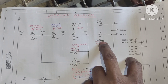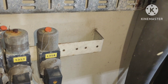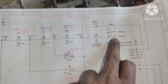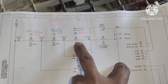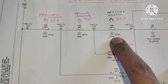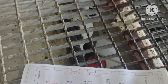I checked the force limitation for parking. Pressure switch 1314 was activated — you can see here pressure switch 1314. I decided to check by using a bypass: we bypassed 367 to 320, but still we cannot lift the hatch cover. So I decided to bypass and check the 36-tonne pressure switch 1313.